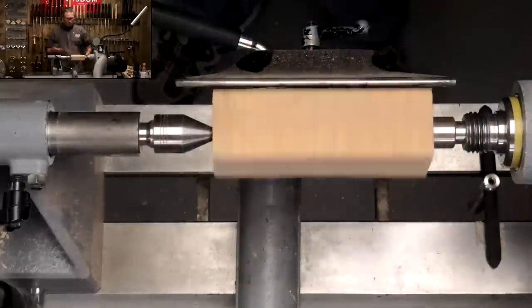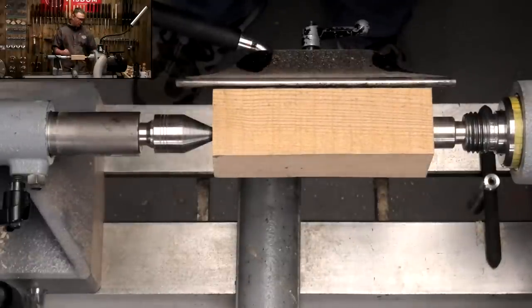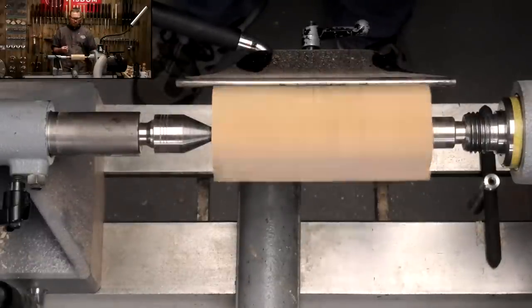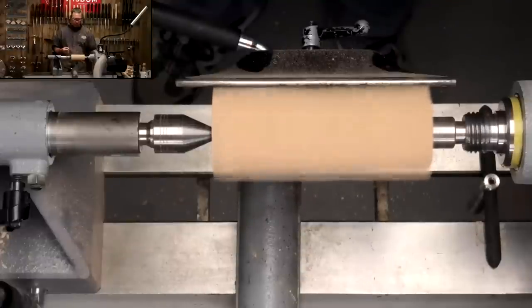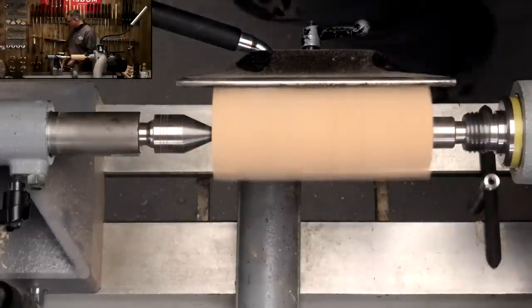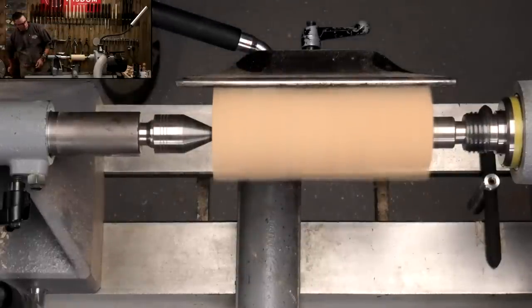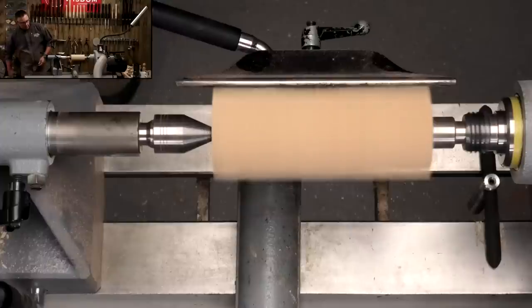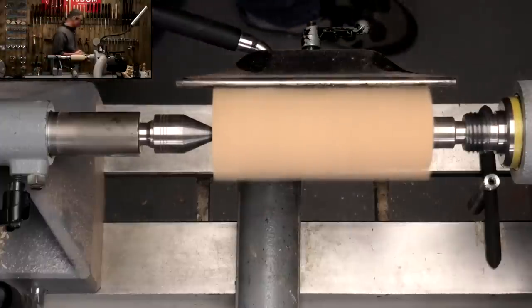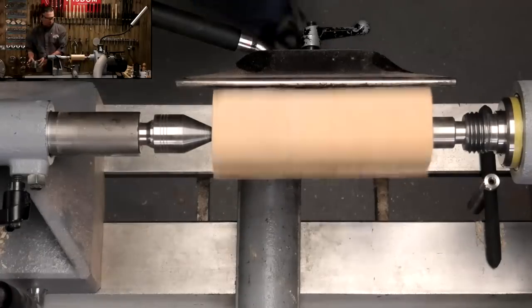So, right, well, what are we going to do first? It's simple. I say simple turning, it's basic turning, not necessarily simple, depends on your skill level. We're going to rough down to a cylinder, then I'm going to hold that cylinder to be drilled. So before I do too much roughing down, I need to decide what jaw I'm going to use to hold the roughed down piece.